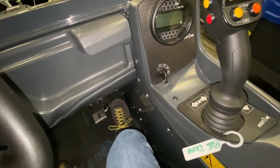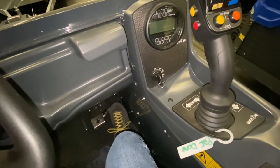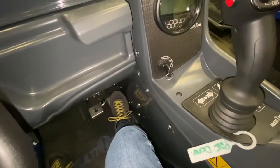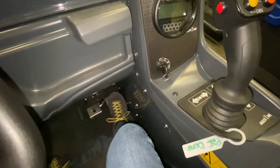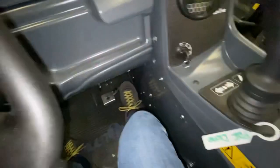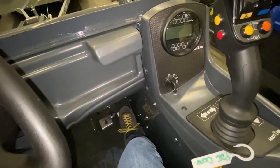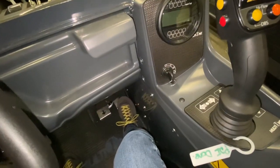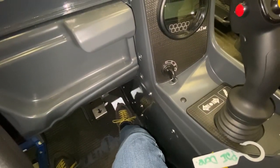To generate pushing force, be prepared to have a play with your machine and get used to just lifting the pedal away from fully down to make sure that your engine is singing and working in a good position of torque, and the pump isn't overwhelming the engine. We sometimes get reports of the engine bogging down — that's because people are slamming the foot down like an accelerator on a car. Whatever position you've got your throttle in, you can overwhelm your engine on a really steep hill or when loading into material. Get used to finding the optimum foot position for different tasks to get power and pushing force into your wheel motors rather than displacement, which is speed.